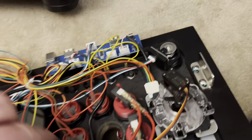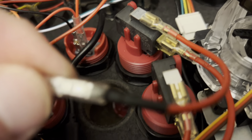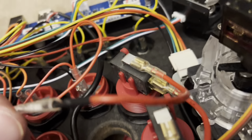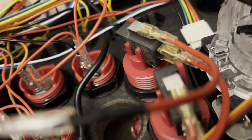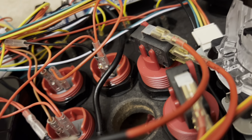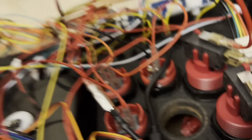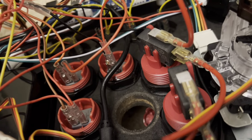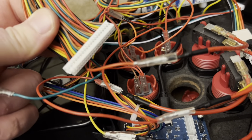That is the adapter I put on there that goes from 0.110 to 0.187, because these are designed for that smaller connector. I realized I could have cut the wire and made another wire, but I don't want to do that. I found these adapters for like a dollar a piece and they just convert, which is pretty easy. Because these all daisy chain off of each other — this one's connected to this one down here, they all daisy chain off each other. And then they go to this thing here that connects to the iArcade board. I'm not a fan of that, but that's the iArcade design flaw, I guess.